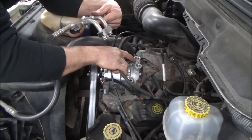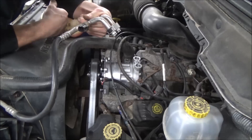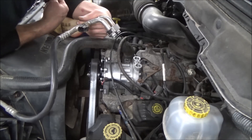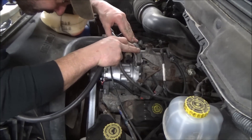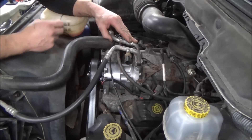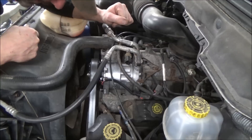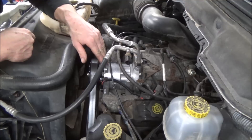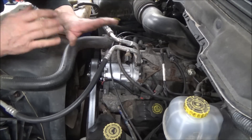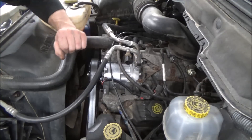At first I thought it was bottoming out on this little boss that sticks up off here. But indeed, it's the overall length of the hose in relationship to the depth of the hole in the compressor. I got all excited — I looked to see the chamfered holes, good. Depth of the hole, no good. The O-ring goes in plenty past the chamfer — that's all good. The little gap left right here in the compressor is super small, but it's just a smidge bigger than the sealing washer. I have other sealing washers that are a little bit thicker — we can stick one in there and everybody's going to be happy. However, I want to call the manufacturer of this compressor to find out if this is a defect, or if there's an updated discharge hose I don't know about. Before we just stick a washer in there and tighten it down, let's see if we can get a hold of these folks.